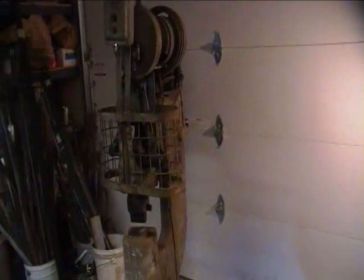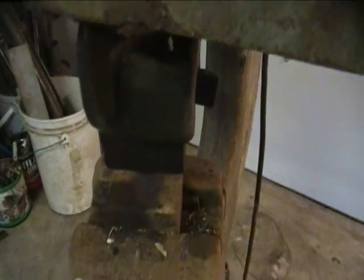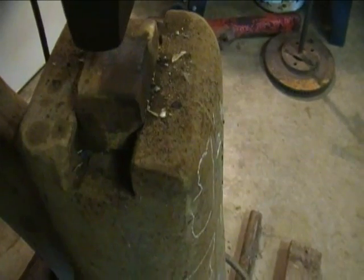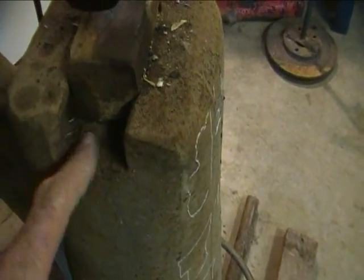The question was, what does it need? Probably the biggest thing it needs is to have the lower die replaced. In this particular situation, this blacksmith bought a really narrow die — no wider than the upper die. They were thinking they'd save money on tool steel, but what they didn't realize is the narrow die gets pounded down into the cast iron here. It's probably pounded down about a quarter of an inch, which is very typical. What you do is take the die out and grind — I use an abrasive cut-off wheel and a skill saw — and level this up pretty good, but not perfect, and get most of this out of there.